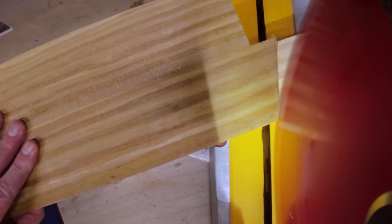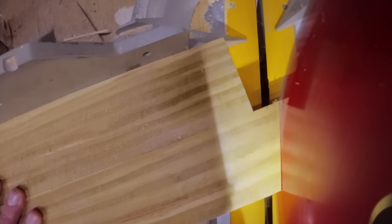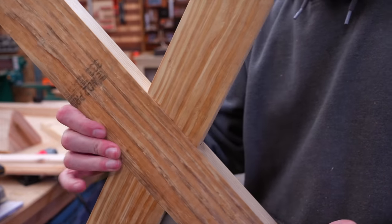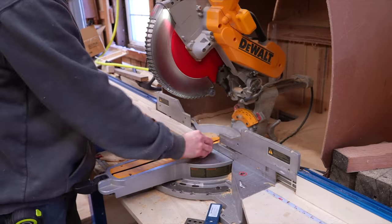There are several different ways you can do this. If you have a dado blade, use a dado blade. You can remove all the material as you go, or you can leave it and get that weird satisfaction of popping all of these pieces out — but then you'll have to go back with a chisel and clean it up a little bit. Totally worth it. Or you can just clean it up one blade thickness at a time. Now repeat this step for all four legs, give them a little test, make sure they fit snugly and you're good to go.